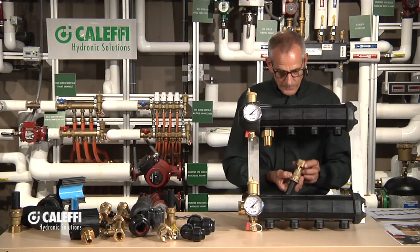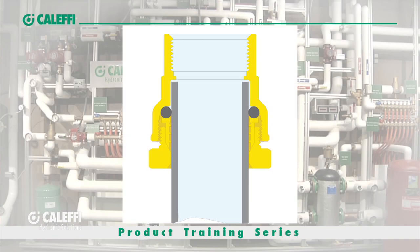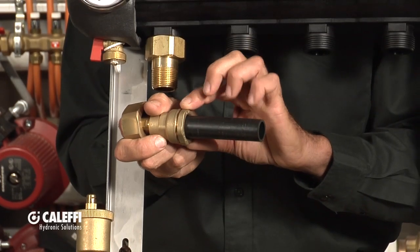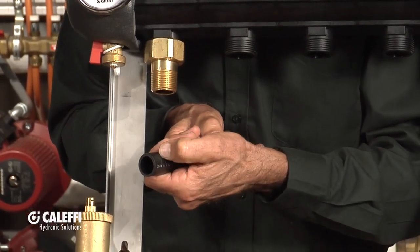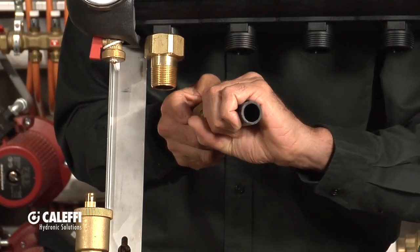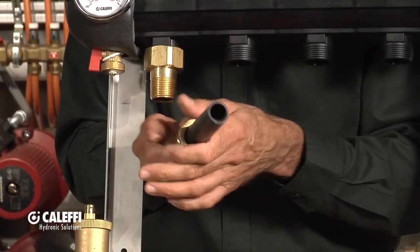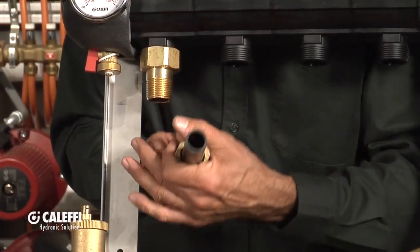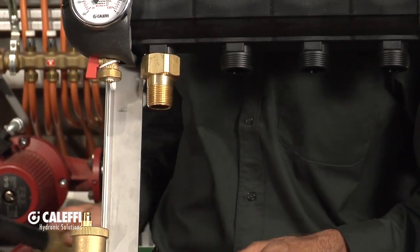The next step is that same fitting but now with our GeoGrip fitting on it. The GeoGrip is a compression fitting — it also takes the heat fusion away from the manifold connection. You slip the tube inside there and tighten it up. When you put the tube in, push it until you feel it bottom out in the fitting, then tighten the nut. As soon as that nut bottoms out, the gripper ring grips right into the wall of the tubing and you won't pull it out. We've put a pull test on this — trust me, that's going to be in there forever.